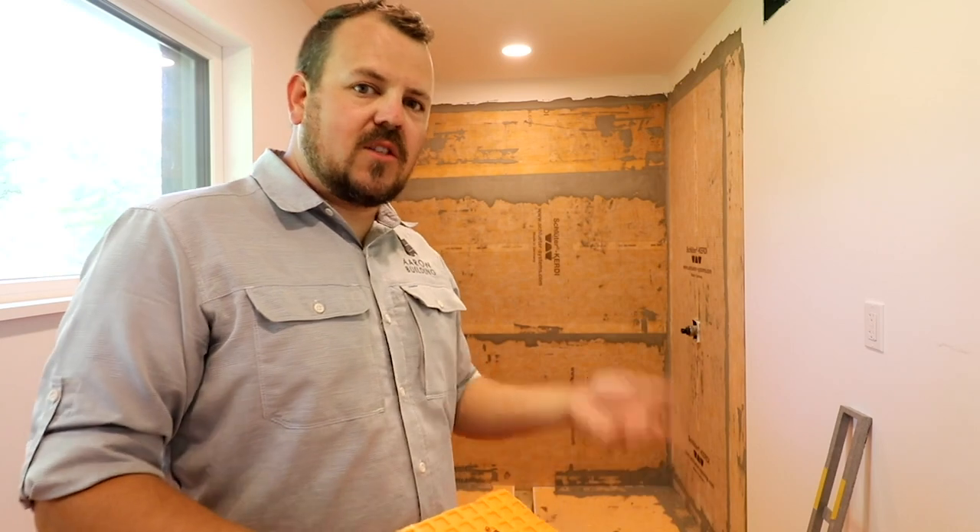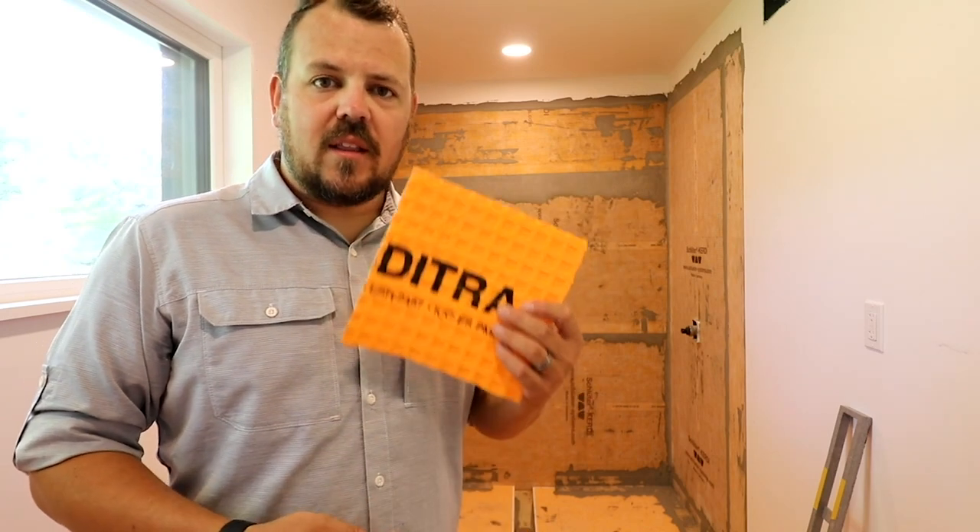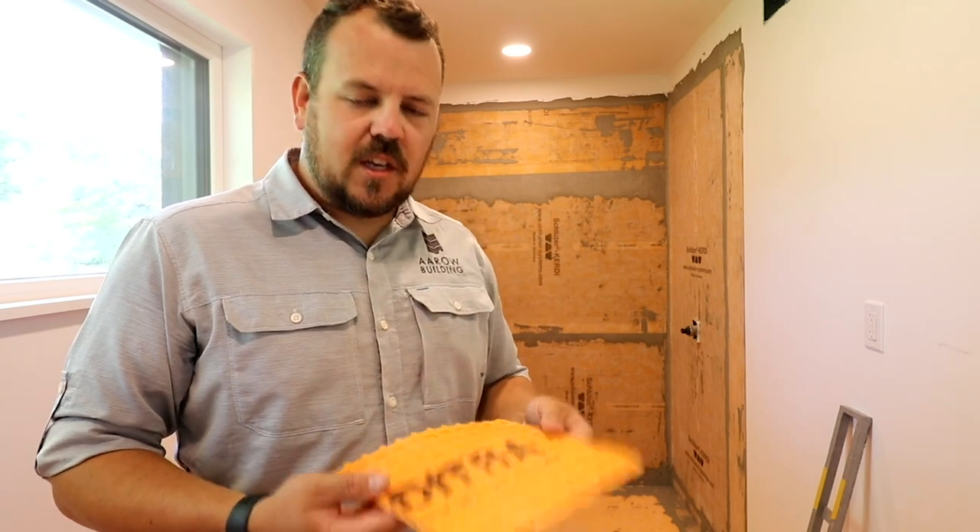If we're building on top of wood like we are here — we're on the second floor — we have a 7/8 inch Advantech subfloor underneath because our trusses are 19 inches on center. In the past the uncoupling membrane wouldn't have existed for us; it would have been mortar, cement board, mortar, and then tile. That causes problems if the building shifts, if the subfloor isn't strong enough, if we have rigidity issues where there is movement in any way, shape, or form, be them structural or just environmental. We want whatever's underneath our tile to affect our tile as little as possible. And therein lies the DITRA uncoupling membrane.